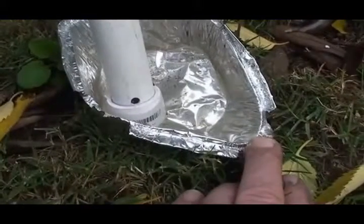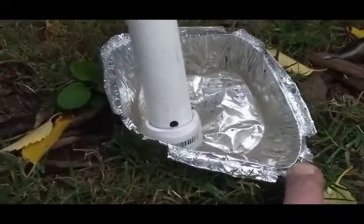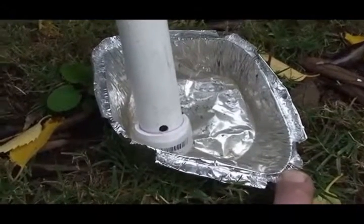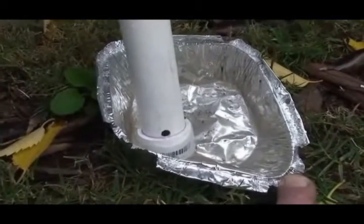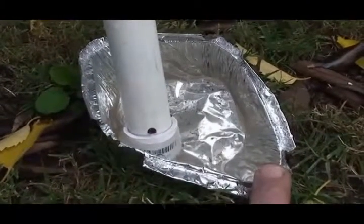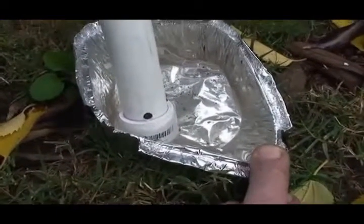Water will be flowing out through the other hole, which is further down, to compensate for the amount of water being displaced. So effectively all this instrument does is maintain a water depth in the bottom of a borehole. If that depth is no more than the diameter of the hole, then you can regard it as vertical infiltration through the bottom of the hole.